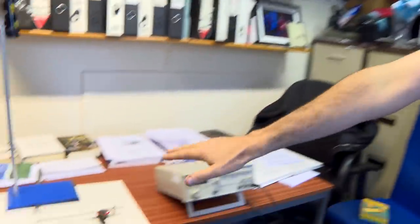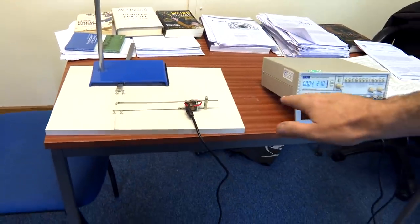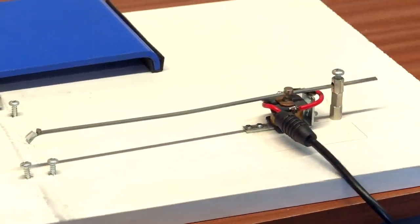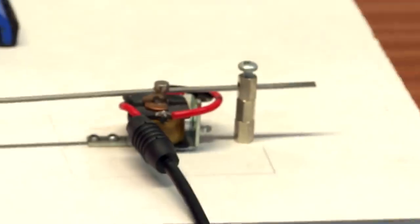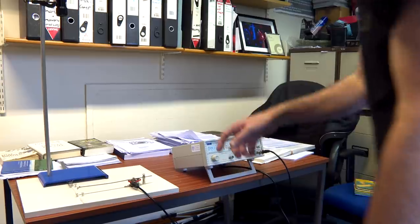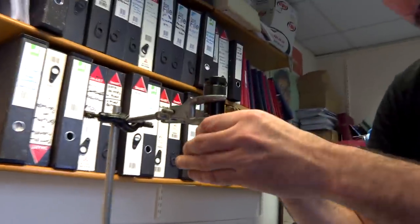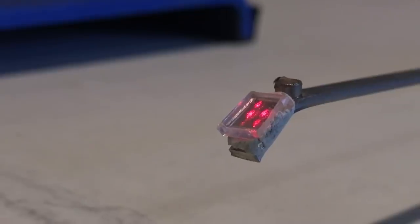Wonderfully, we've got a mechanical setup where we can see this idea of resonance really straightforwardly. This is a very simple setup. We've got a bar — a ruler, basically — and it has its own natural frequency. We're going to drive it mechanically. There's a solenoid here and there's a magnet, so we're just driving it back and forth with a magnet. And to monitor the motion, we've got a laser pointer, which will tell us just how much this is vibrating — the laser goes down, bounces off a little mirror, and reflects back.